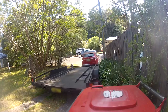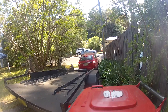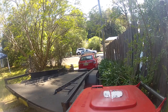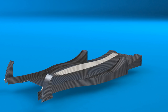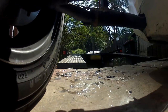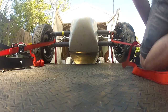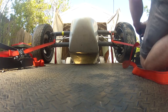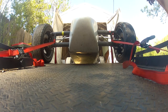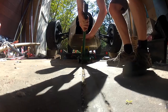With the tray now nearly complete I set to work attaching it to the car — this was a mission in itself. From the bottom, the wheels are the only part of the car not above the tray, which leaves nothing available for lifting the car to install the tray. I had to get creative. I made use of the trailer, pushing the car onto it such that the front wheels were just up on top. I tied the front of the car to the trailer both forwards and backwards so it couldn't move or fall off, then jacked up the rear and put the wheels onto blocks to lift it off the ground. I was able to remove the ramps leaving the car hanging fairly high above the ground.